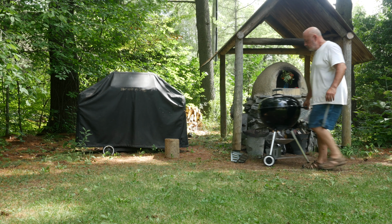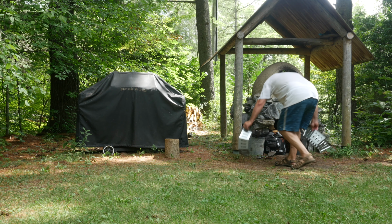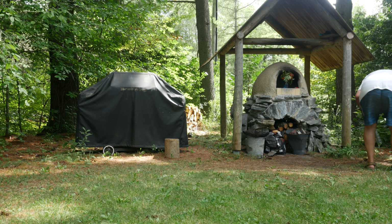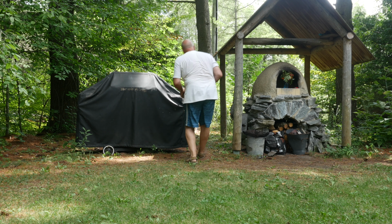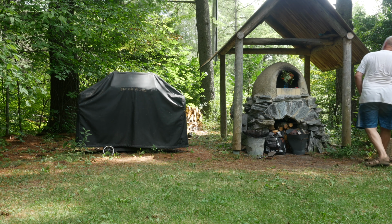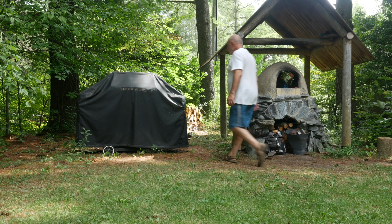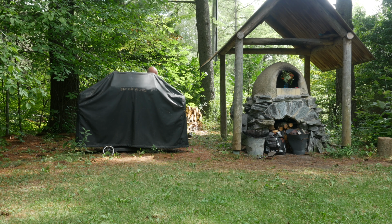Conceptually, it's a pretty easy job. Dig a trench, put some conduit in it, run the cable, hook everything up, test it, and backfill. And of course, you want to start with some good site prep. Make sure that you're not going to be going through any major tree roots. Make sure you're not going to be going over any existing power lines or cutting through them. All the stuff you would do to make sure you don't make a huge mistake. In my case, everything went pretty much according to plan, but I'll share some learnings with you at the end of this video.